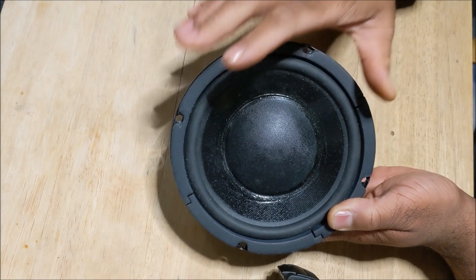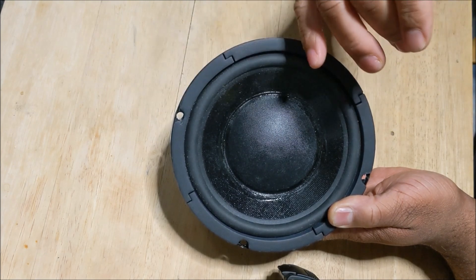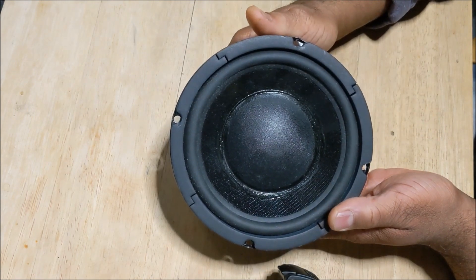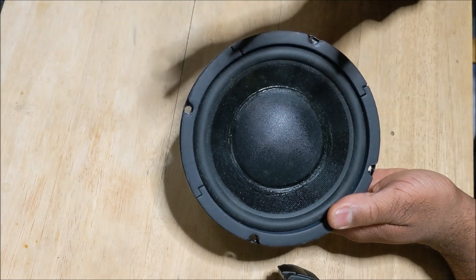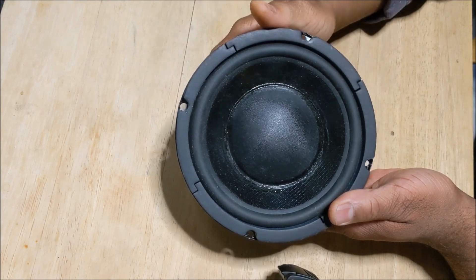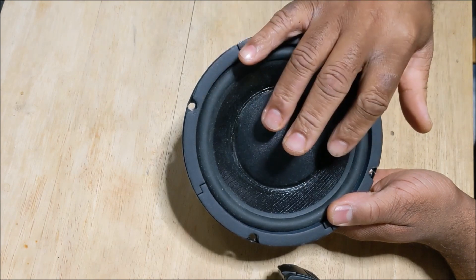What's interesting is I don't know if it's from adding this 3-inch dust cap or if the driver just has really bad breakup at that point. I don't really know, because I don't have one of these drivers without this dust cap — I just have a pair and both of them have it. I'm thinking about getting another one of these drivers to check out the response, because from the manufacturer's chart it's flat, so it should not have any peaks around 3,000 or 4,000 Hz. It is clearly audible and really harsh sounding.